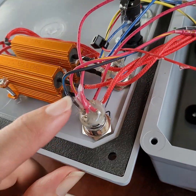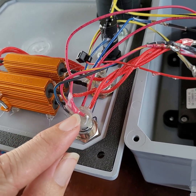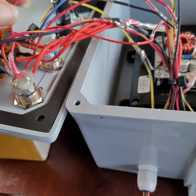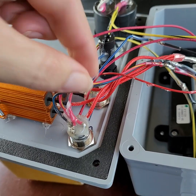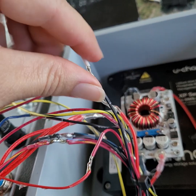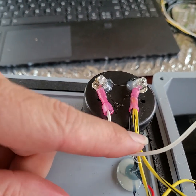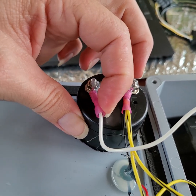It may look like a bit of a mess, but since this is going in a moving vehicle, it was important that all the wires had support a good distance away from where they were saturated with solder. Because if a wire is tinned inside with solder, it's very stiff, and where it wiggles there's a break point — it will end up breaking. So here we have actual wire with a little bit of flex support from the glue, which should handle thousands of miles of vibration. The heat shrink goes beyond the area where the solder is soaked in, and this collar gives it stress relief, allowing the wire to flex more gently.